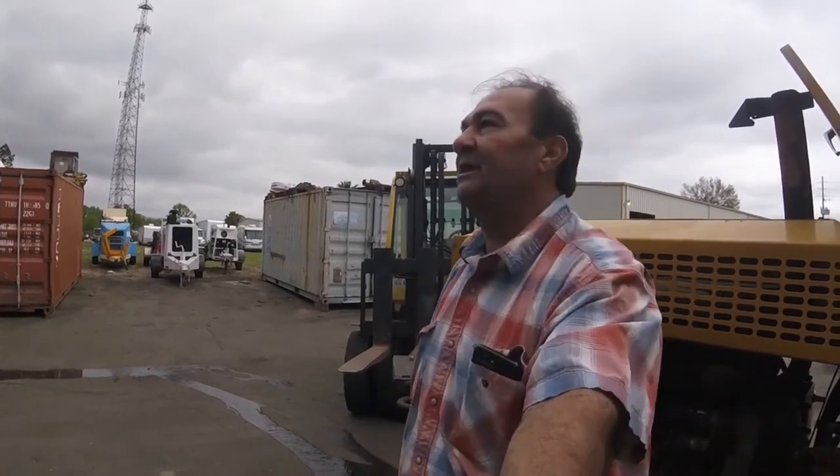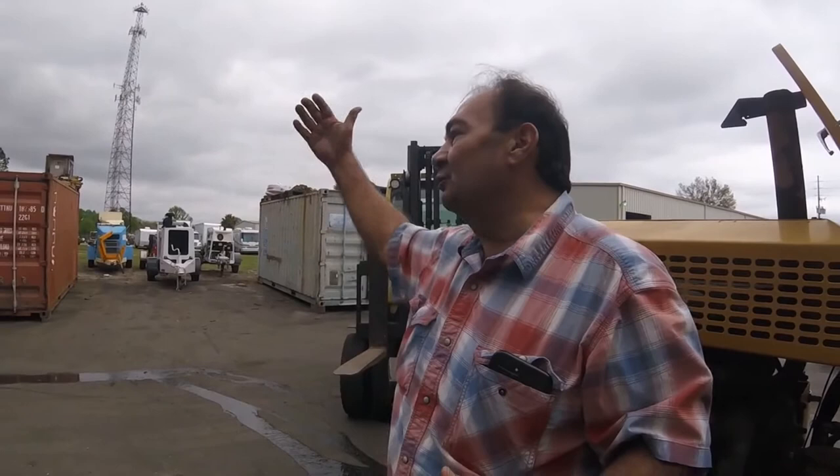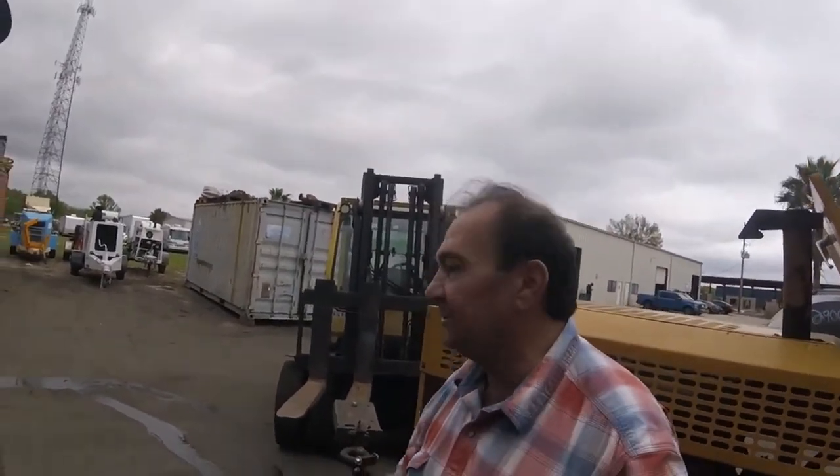For example, I was telling Edward, guy calls me up, and this happened before. Because I used to run work for Conco back in the day, we were partial to slick line, less friction. A lot of these guys don't even have an idea. So if a guy says, hey man, I got to pour some concrete at a 3-inch slump, it's only 3 yards for some casing, okay, but it's 400 feet.